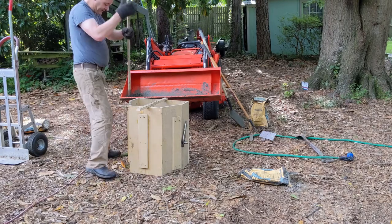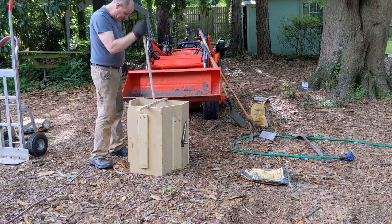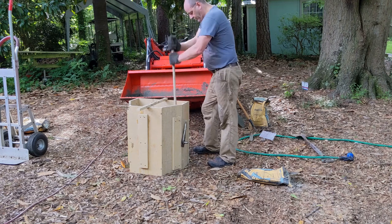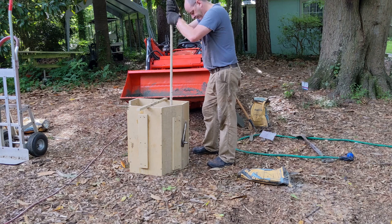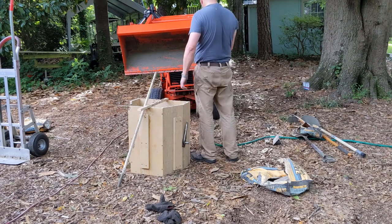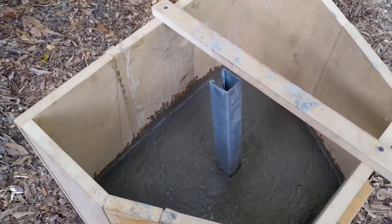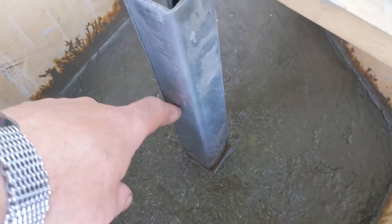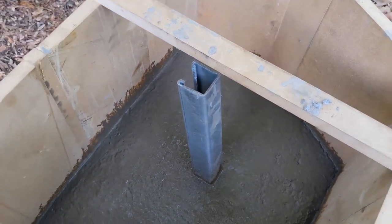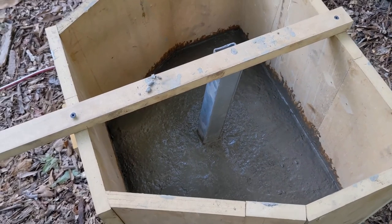I'm going around with this stick and tamping it down really hard — the idea is to remove air pockets, make sure the concrete is shuffled well down where gravity has it pulled down and outward to the form with no artificial bridge. I almost forgot to insert a vertical member for the top link to engage in, so I'll weld or bolt some ears to these outer faces — saves me having to drill it — and engaging the top link is the sure way to get it just right.